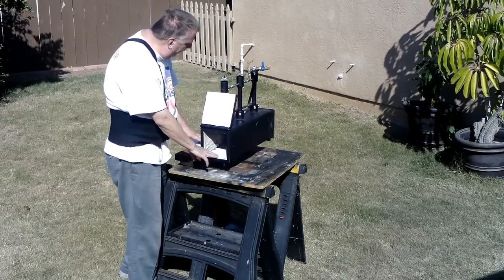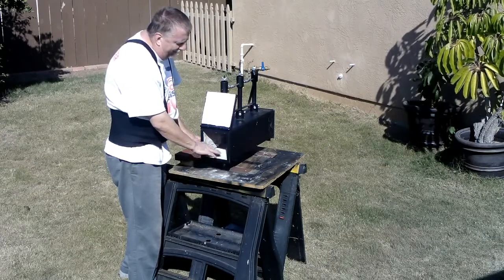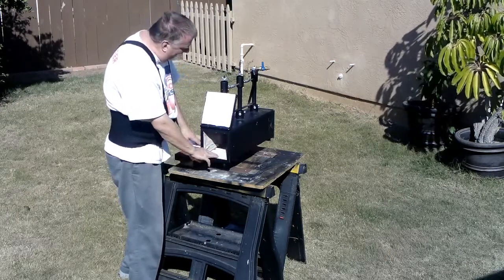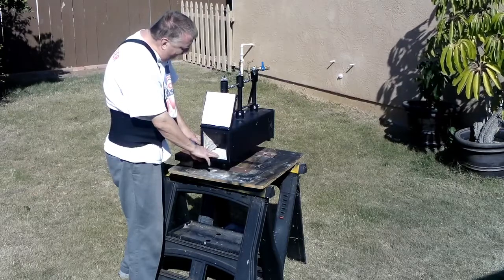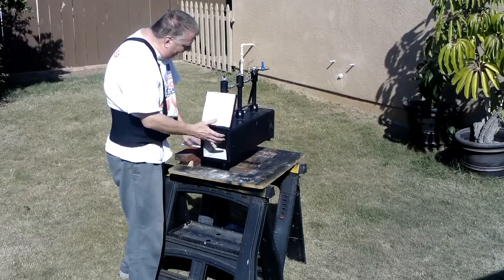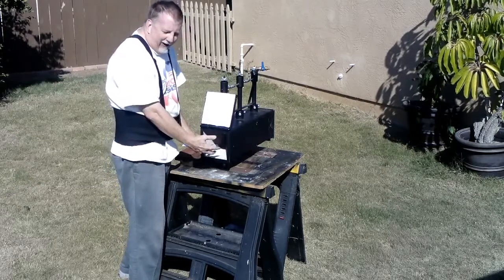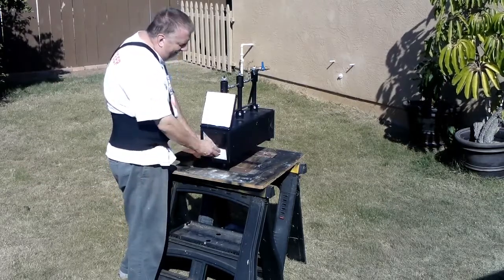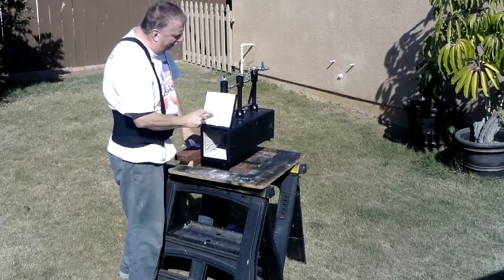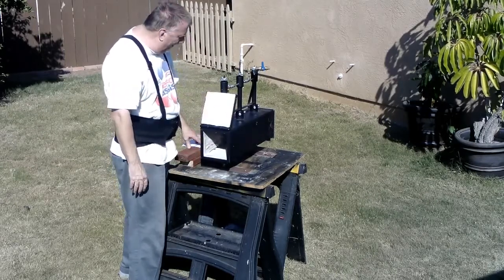I coated this forge with the SimWool rigidizer, let it dry, baked it with light bulbs, and then coated the surface with the ceramic radiant heat reflection coating, which is supposed to help keep the heat inside. Anyway, long story short, I neglected to do anything with kaowool on this board, so I'm going to try to rectify that situation now.